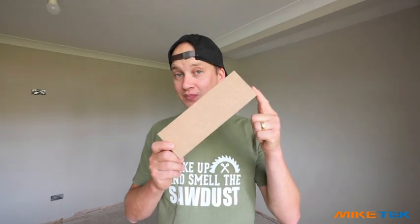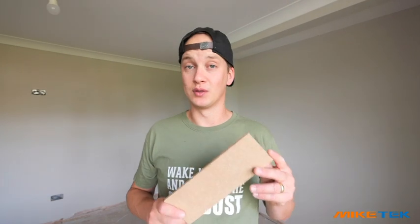With the MDF panelling, you'll want to get full sheets of MDF boards, and then you'll cut them into strips like this. Or if you haven't got anywhere to cut it, you might be able to go down to your local DIY shop, ask for a full sheet of MDF in 12mm, and ask for it to be cut into strips of the size that you want.